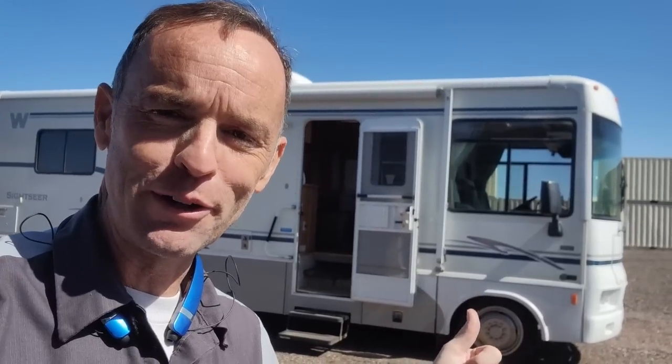If you do own a Winnebago or you're interested in buying a Winnebago, it's absolutely a vital check, not just to check the sealant right here, but check on top of the roof, make sure it's not delaminated, falling apart, because of its very unique laminated construction. A little bit of a failure will be quite a costly failure very, very easily and very quickly.